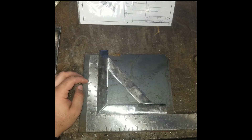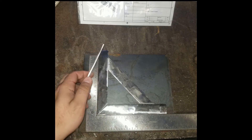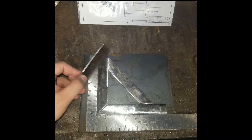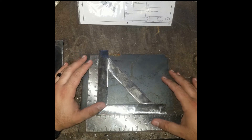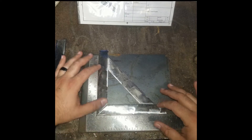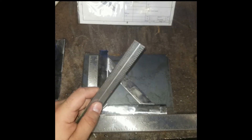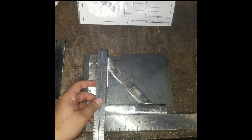All my pieces have been cleaned up, including the foot piece — that flat bar that's going to be welded to one of the sides of our square. Keep in mind that even if you just grind the areas that are going to be welded, you're basically removing the layout lines we used to lay out our pieces. So always make sure you have something to measure with so you can verify your fit-up before welding. If you weld before you get your fit-up right, you'll have to break it apart and do it all over again.